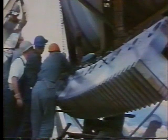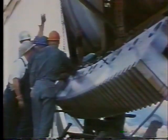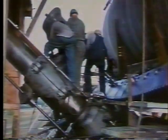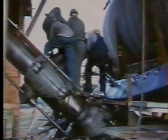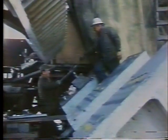maintained. Reference was made to a master block each time a new segment was being set and checked by pin indicators. Once checked, drilling and welding, reaming and driving of bolts were all part of the operations necessary to set and hold alignment. A total indicator runout of plus or minus 20 thousandths of an inch was achieved.